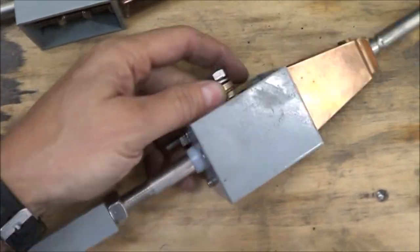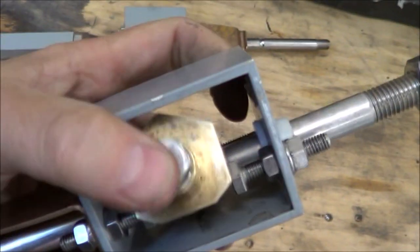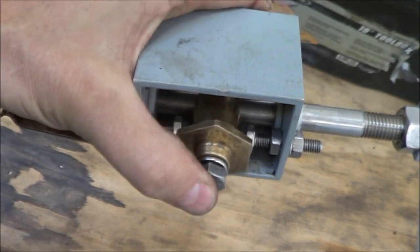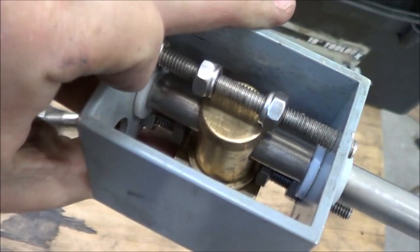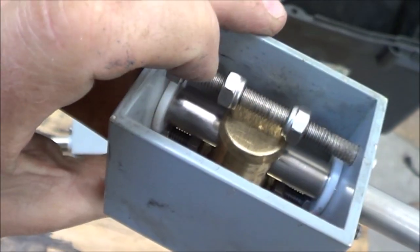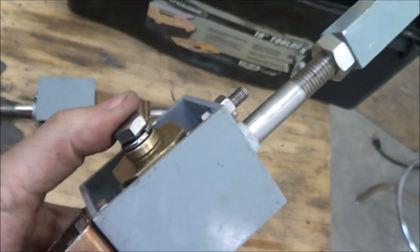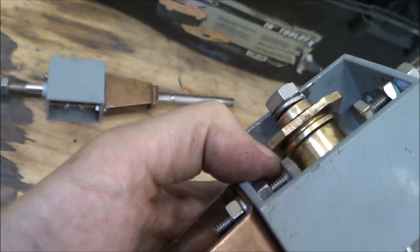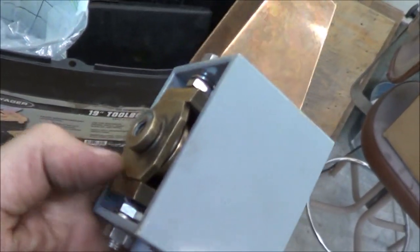So you can see, let's zoom in close so you can actually see that this guy actually wiggles back and forth. It doesn't actually slide back and forth precisely on the bar. It actually rotates just a little bit. So that little bit of rotation is taking up some slop against this slider, which implies that there are friction points at either side of the brass fitting. So that's really what's happening. This brass fitting is having trouble sliding on this guy because there's a rotational torque, and that rotational torque became more obvious when the contact point is lower on the brass fitting than it is here. So that's why it got worse.